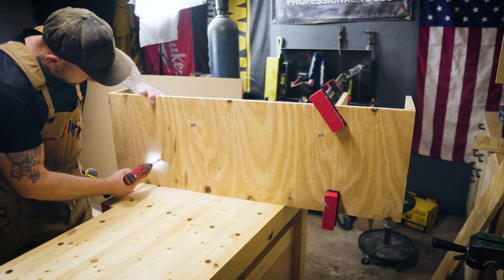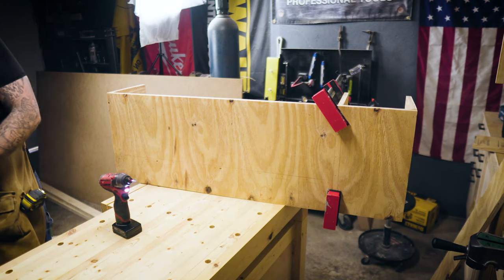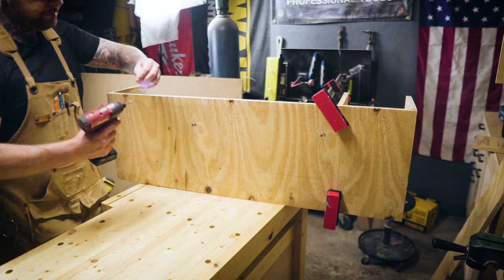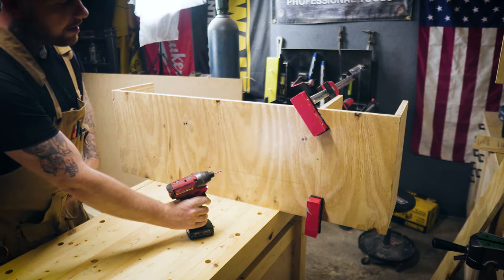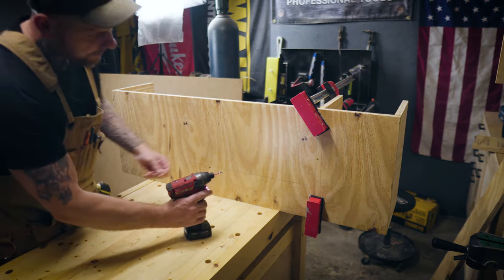Now the shelves and the back and the top are typically the spots you have to worry about using this wood because this wood is not good and straight. And that's why I said using the birch wood would probably be a lot easier because that wood is a lot easier to work with. So you would save yourself a lot of time.